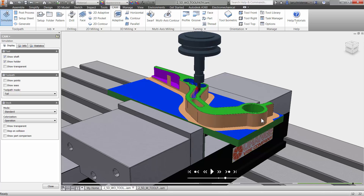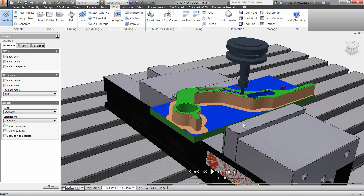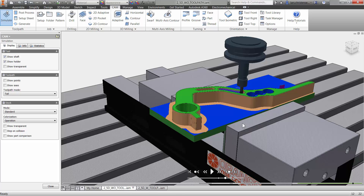This part is in a bit of an odd shape, so flipping it over will make it a little hard to hold. This is one of the great things about being inside a program like Inventor. What I used to do is buy some 6061 aluminum and machine it into the same kind of size — maybe a little thicker than the vise jaws. I would machine my own soft jaws — aluminum jaws — you can buy them, but I would go out and buy maybe 10 blocks of 6061 or a long bar and cut to size.